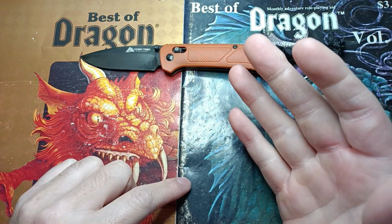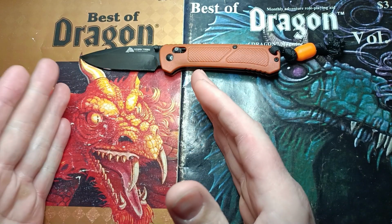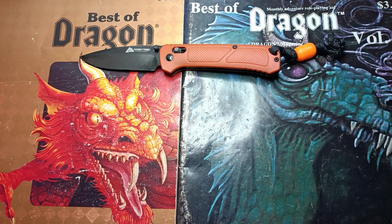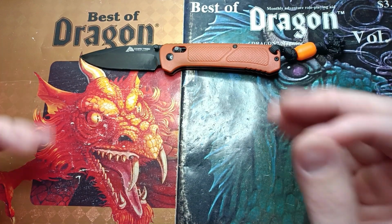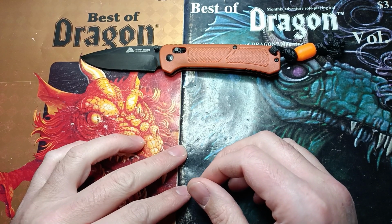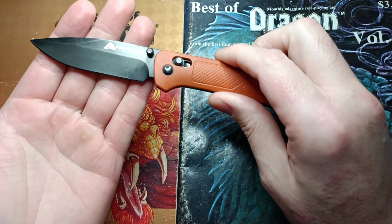I didn't want to have to do it because I knew it was going to be a lot. But normally we'll average like 800 to 900 cuts in about an hour of cutting on single wall. So a lot of feet of cardboard it went through. And on the 17-degree edge, it went for about 8 hours on that set. So we know this one is good.